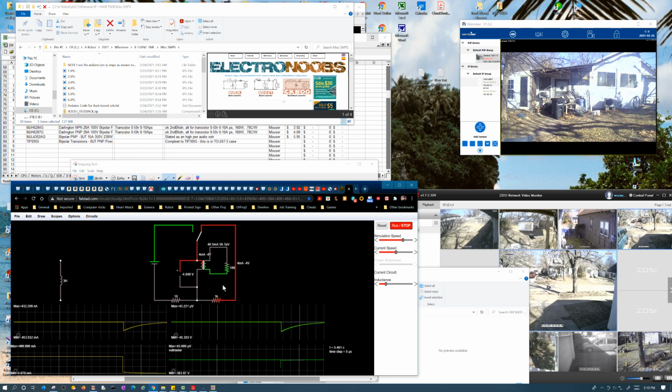But again, it's still a significant fraction of this. It's 100 ohms here, 1,000 ohms here. This is why it's getting 50 milliamps. This is getting 450, and this is getting the extra 50, because here is the ratio. You know, it's a 10-to-1 ratio. So again, the discharge circuit has nothing to do with the charge circuit. So that's why we're getting this current sharing, because of this.